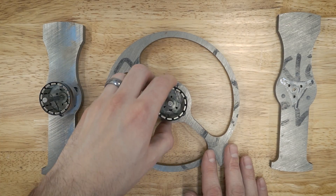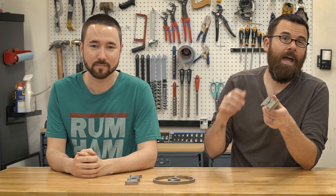So there you have it — we just finished machining the S7 tool steel weapons and it turned out great. It was a little trickier than we had hoped, but the end result is fantastic. This gives you a better idea of what it's like to machine S7 tool steel on a 440 Tormach. It is totally possible, it is not fun — you're not going to have a great time — but it is totally doable, especially for smaller stuff like this. I really don't like dealing with the one-eighth-inch end mills; they're always a bit tricky. If you have any comments on how to reduce the squealing or better machine with an eighth-inch end mill, let me know, because I'll probably be doing more S7 tool steel in the future. Overall, really happy with how these turned out. Thanks for watching — check out my Facebook page for updates, and my Patreon page to support the channel.